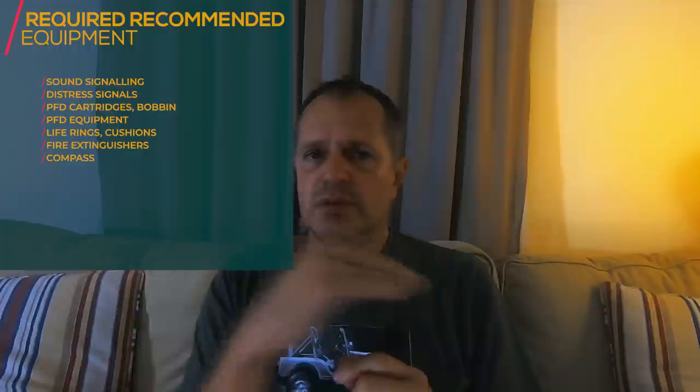Check and adjust the compass. Some compasses you can adjust, so you can do east, west, north, south. So you go on a northerly route and you check that you go according to your electronic chart plotter on a northerly route, and then you adjust your compass. Make sure you go to the magnetic north of your chart plotter, not the true north. And then you can adjust your north, then you sail on a west-east passage, and you also mark where you adjust your west-east adjustment screws.